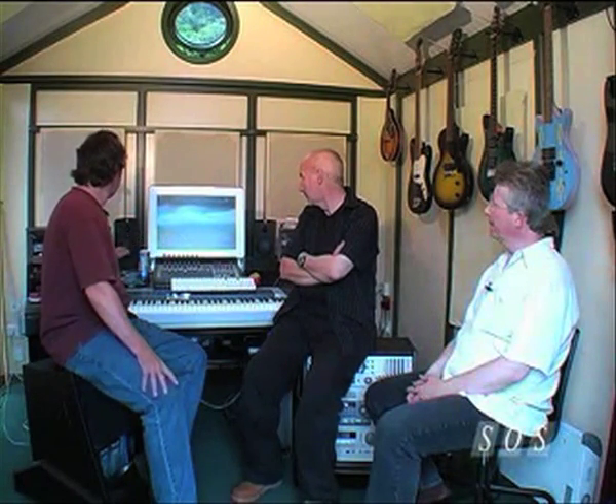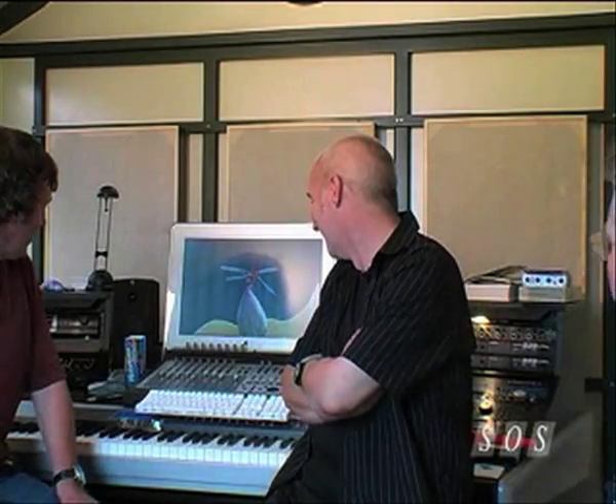The tweeters should always be pointing roughly at your head — as it was, these were on the bench pointing down, probably pointing at your navel. The room to me sounds drier, more even. I can hear it as soon as you walk in. You get that feeling — even if you didn't look up, you walk in and you know something's different. The ceiling feels closer or further away or whatever, but you're not getting that sense that you're in a shed.